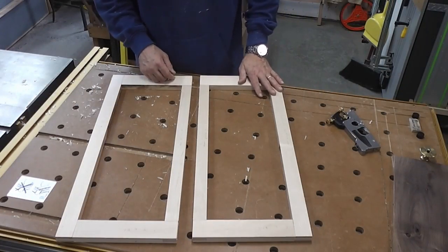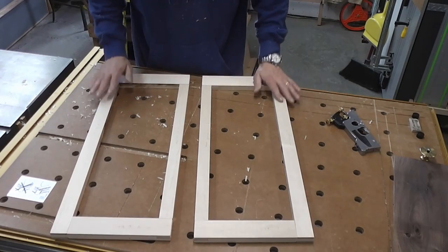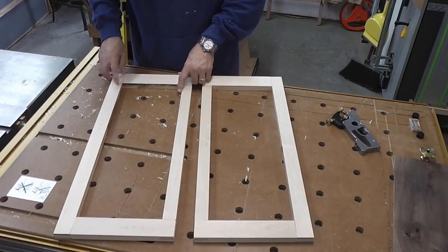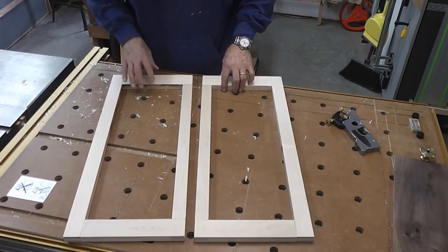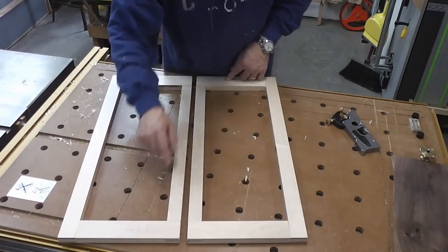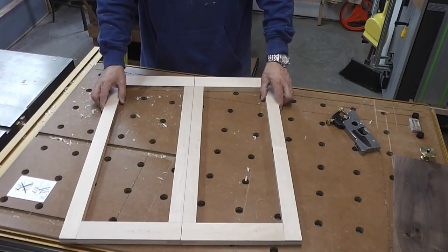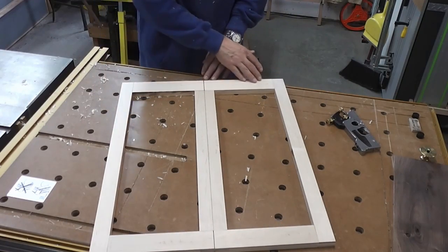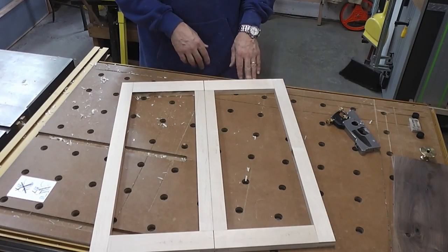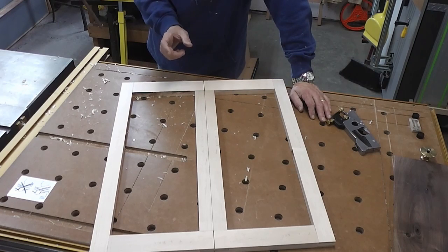It took some coaxing — probably about a half an hour or so with my shoulder plane — but I finally got these doors fitted together. There's a nice tight friction fit on these. It doesn't expand the outsides of the bridle joints, which is nice. I still need to clean up a couple of the corners and I'm not completely 100% happy with some of the joints, but I'll fix that later. As you can see, this was one piece of wood and this was one piece of wood, and the stile goes up in here. Now, normally the stile would go all the way at the top to the bottom, but when the doors are put together like this, there's not going to be any grain interruption between the two except for about a sixteenth of an inch.